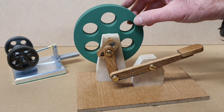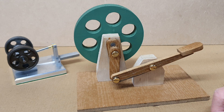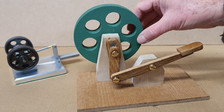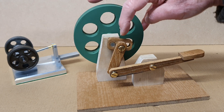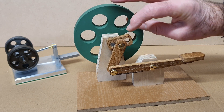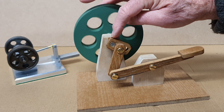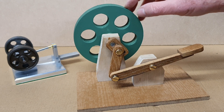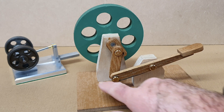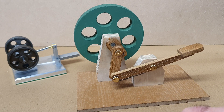This was the difficult part actually — getting the arms the correct length to balance the whole thing out. To start with it just wouldn't work. I tried all sorts of different ways, configurations. I thought I'd put the pivoting point here in the wrong place, and you see there is a hole here where it originally was. I moved that a bit closer to the shaft point here but it still didn't work. And then I realised I probably made this arm too long — it was very much longer. So I cut this down and sort of re-drilled the holes here.